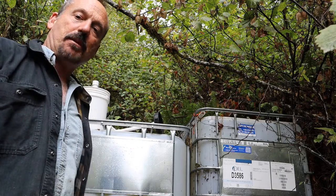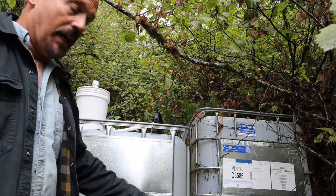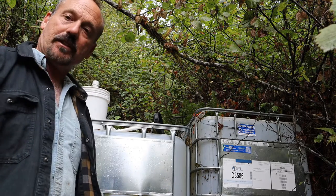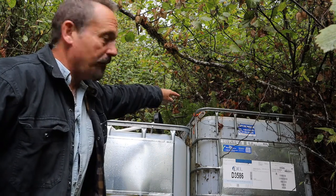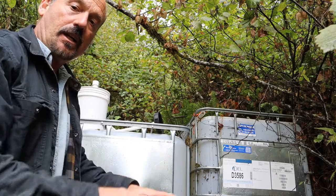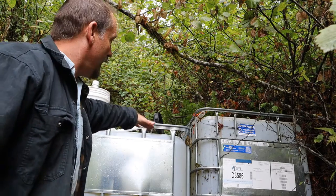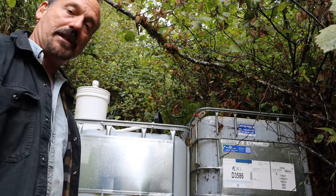My tanks are up on the hill. I had this 330 gallon tank and then I bought a 270 gallon tank. I leveled off the ground in the same spot, but they aren't going to be the same height. So when I have water up to the top of this one and connect the two tanks together and they equalize, water will come running out the top of this one because water runs to the same level. I should have kept this one up higher so that the tops matched up.